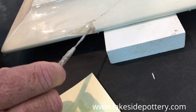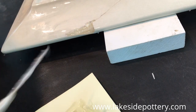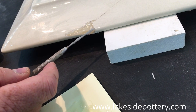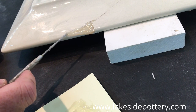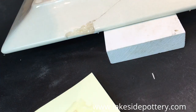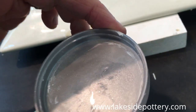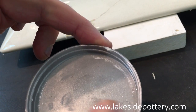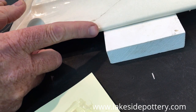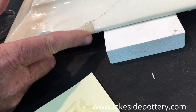After the rough fill, you have to go back and use PC11, the finer filler, to fill all the little imperfections of the PC Super Epoxy. You can see it's not a perfect layering. Sometimes we take 91% alcohol, pour some, get a finger in to create a layer so the epoxy won't attach to your finger, and you can smooth it if you touch it very gently. Some people use spit.